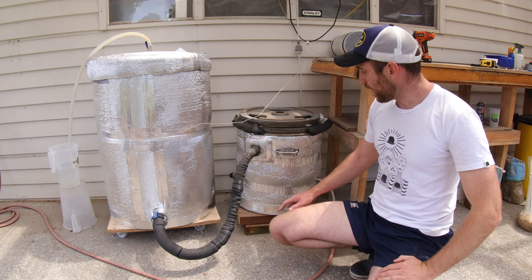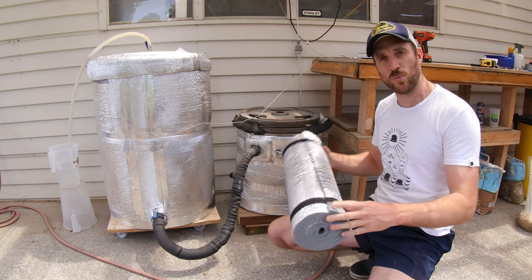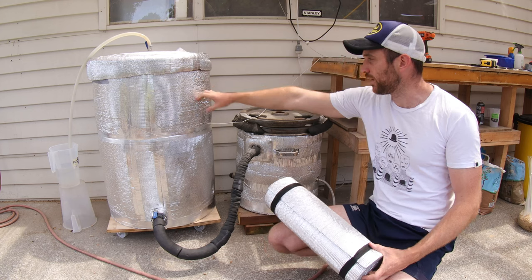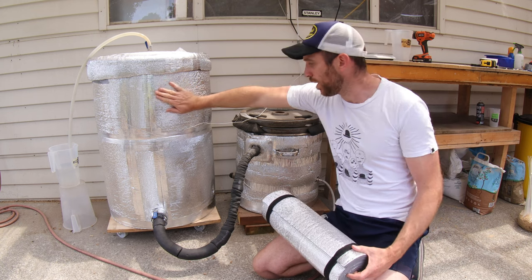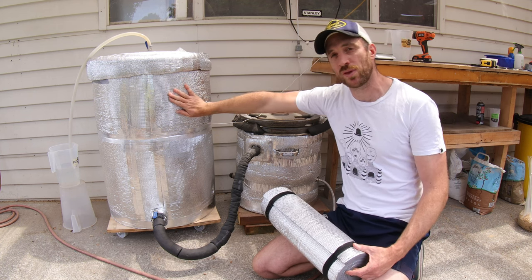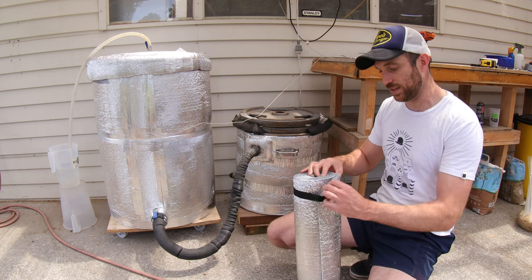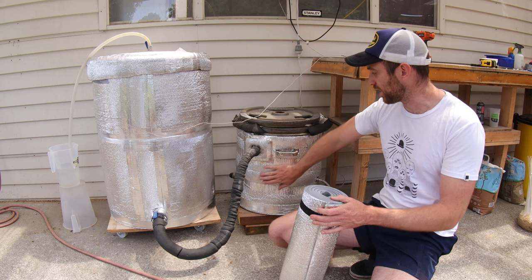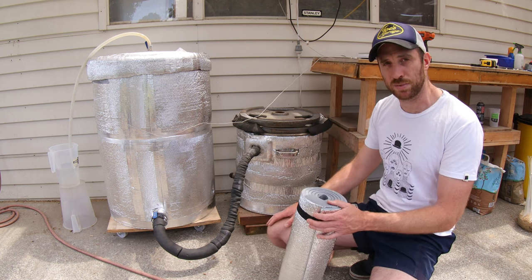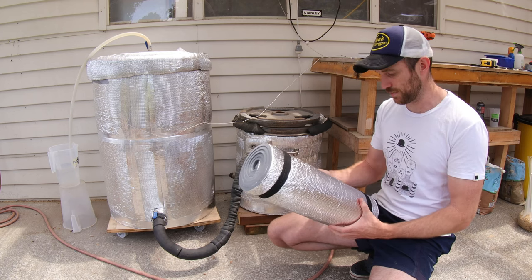It's really thermally efficient. What I've covered them in is these camping roll mats — about $10 each — which are a closed-cell foam on one side with a foil backing. I've got two layers on each one and that does a really great job holding the temperature. At night when the temperature drops, you wouldn't feel much warmth coming through at all. The boiler also has two layers on it. If steam hits it directly it does start to melt, but if it's just touching exposed metal it keeps its shape and retains its insulation properties, and it's really cheap.